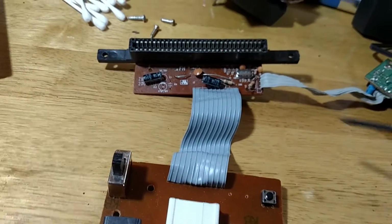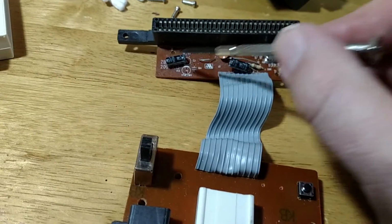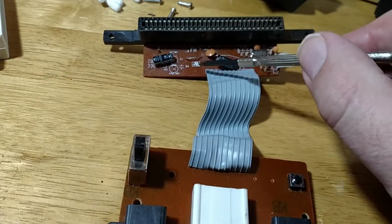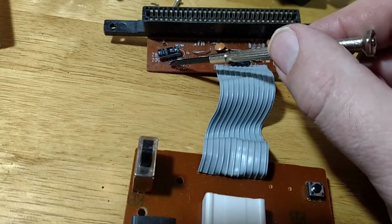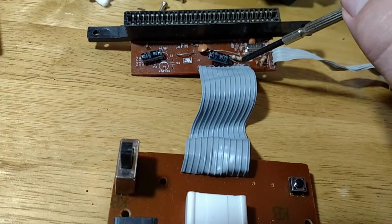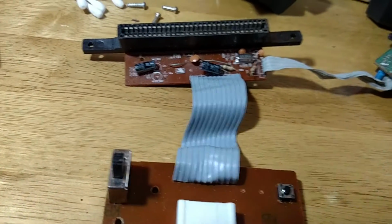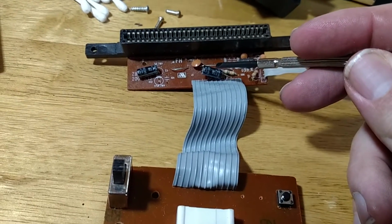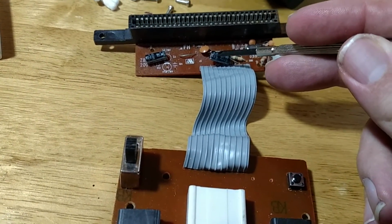And eventually I've done a little bit of looking, and the capacitors here and here, I think this capacitor is wrong. According to the board, this one should be a 1 UF, and this one should be a 10 UF. There should be 16 volts, which again, you're running only 9 volts through it, so you can go whatever. But this one here is a 1 UF, so I think that's why it's rolling.